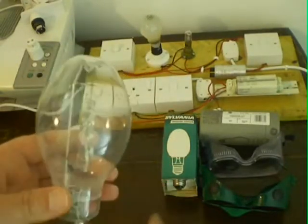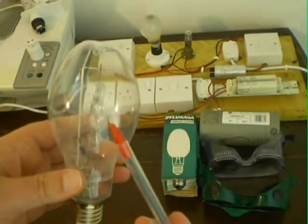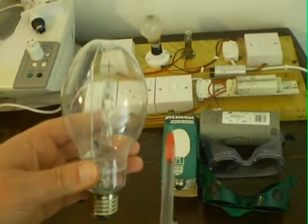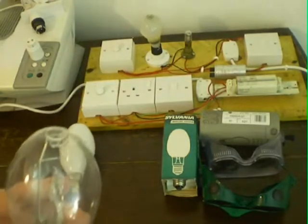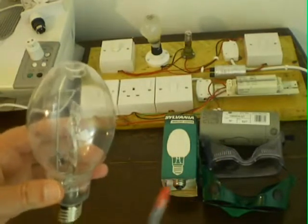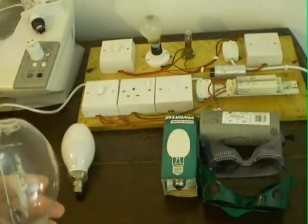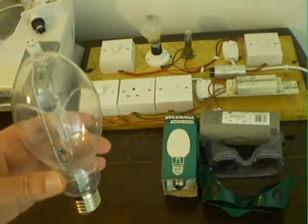The arc tube in these mercury lamps is made out of a special type of quartz glass, and that quartz glass allows the short wave ultraviolet radiation to escape, whilst the outer glass casing on the bulb is made out of a borosilicate glass which is designed to block the short wave ultraviolet radiation. Needless to say, if you are in close proximity to this lamp you should wear protective eyewear, as these uncoated lamps do emit very high levels of long wave ultraviolet radiation because there is no phosphorus to absorb it.